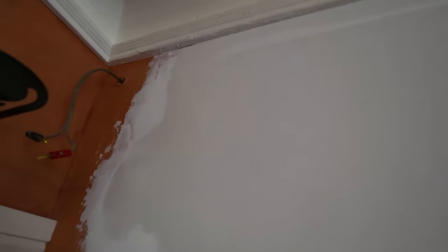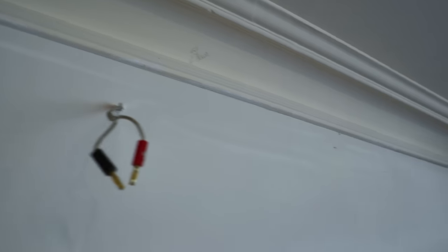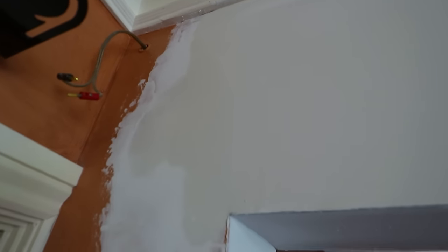If you've got areas on the angle beads that look a bit rough, don't worry — they'll all just knock off when it's dry. You can see how it's done — it's quite straightforward and simple. I can see areas drying now across the top where I only did a fine skim over the scrim tape going across. I've feathered it out on the filling there. I've floated the RSJ beam out and hopefully when it's sanded down it'll be nice and smooth.